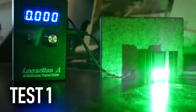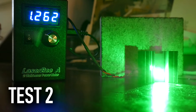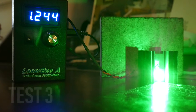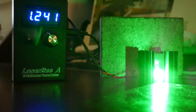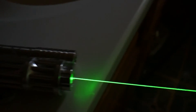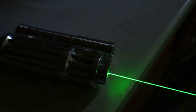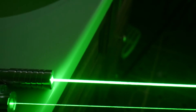Now for the LPM test. Test number one peaks at around 1,370 milliwatts — 1.37 watts — from a cold start with a fully charged battery. Test number two sits around 1.26 watts, or 1,260 milliwatts. Test number three is very close at about 1,240 milliwatts. All on par with the advertised 1.2 watt rating, even a little over. Subsequent tests gave similar results.